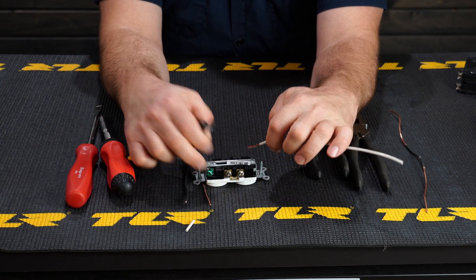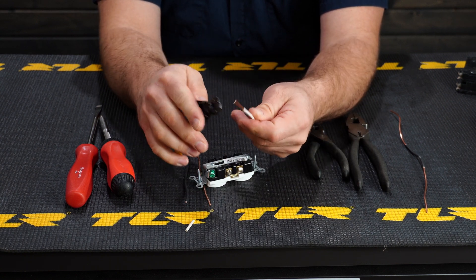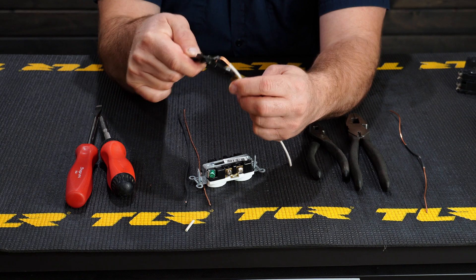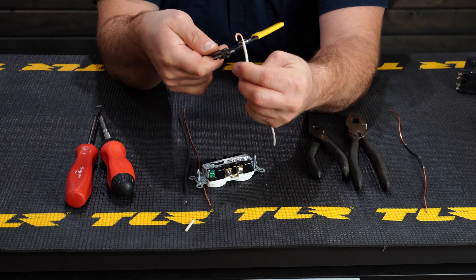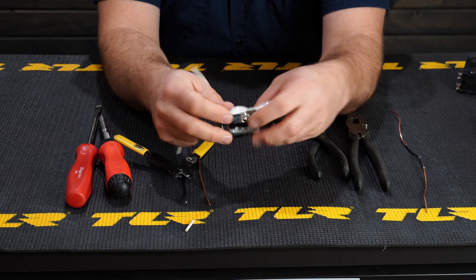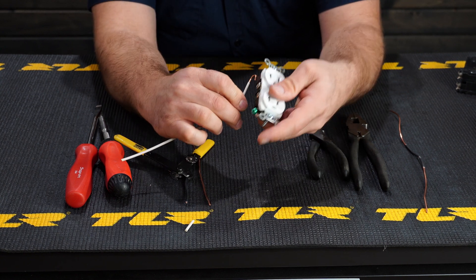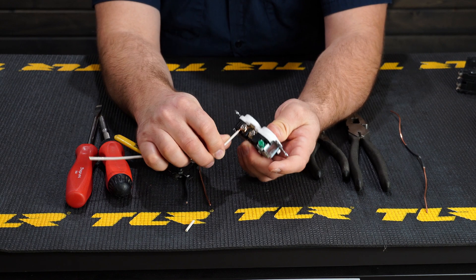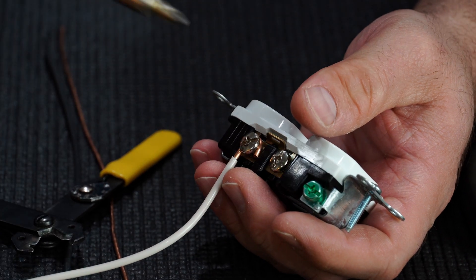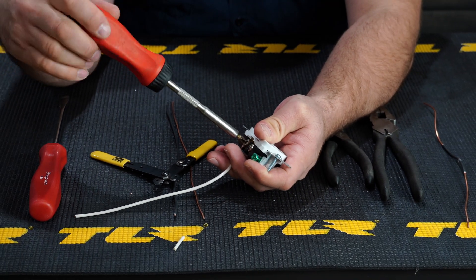Some outlets have a little marker to indicate how much wire to strip — give yourself approximately that much. The two holes on the wire strippers are meant to hook the wire and create a nice U-hook bend. When you do that, the screws are open and you hook around the screw. Try to stay clockwise when hooking because you'll be screwing clockwise, which gives the best security.